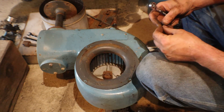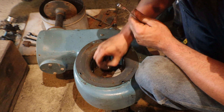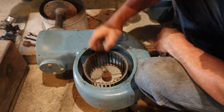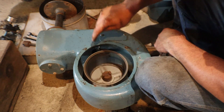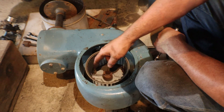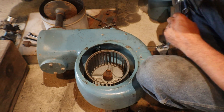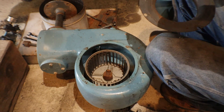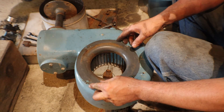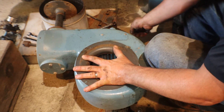There is my assembly. Now the bearings in the motor are actually what support the squirrel cage. And that's what we have inside - nice little blower. Now you want to spin these if it's something you're reusing. Make sure you don't have a major wobble in that thing. There's a little bit in this but it's not bad - it's actually quite livable. Squirrel cages are actually pretty easy to find, you can get those relatively cheap, relatively easy. This part right here is quite important - if you don't have this part it's not going to suck air the way you need it to. You need it to suck the air in through here and push out the other side.